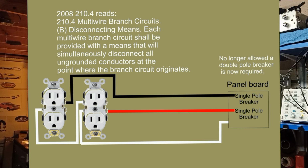And normally you would not have a 220 volt device specifically for a circuit like that. The heater in that other room, where I disconnected the wall mount one, and then tap 120 volt off of 2 of the conductors, that's just a no-no. That's something you're not going to want to do.